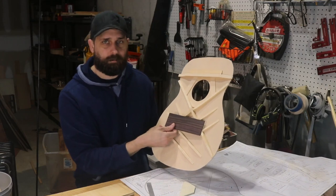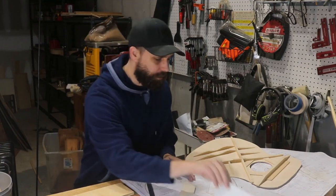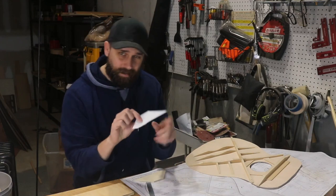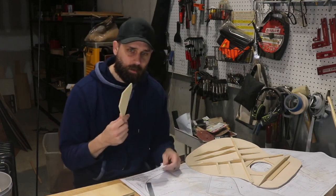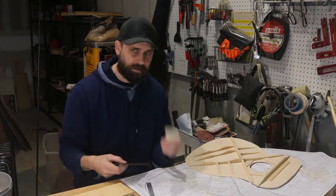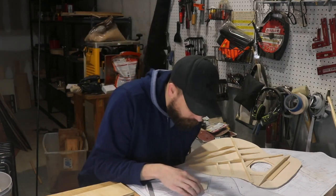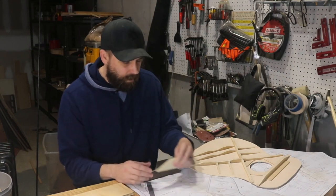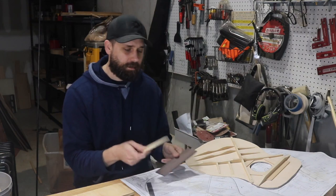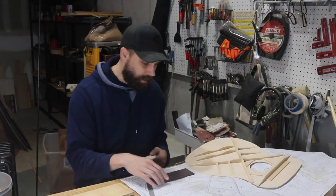What's left is the bridge patch, and that's some Indian rosewood. I took my plans, traced out the shape of the bridge patch onto a piece of paper, cut it out, and then traced it onto a piece of plywood and cut it out - so this will be a reusable template for future bridge patches. It doesn't exactly match up perfectly so I need to do some shaping, cleaning up the edges and making the lines straight, then transfer it to the actual bridge patch. This should work for any future X-brace style guitar.